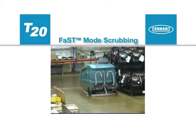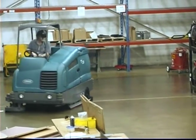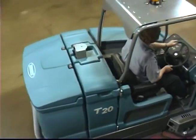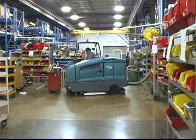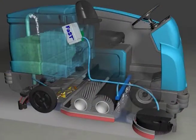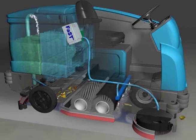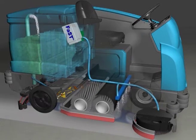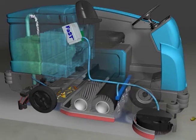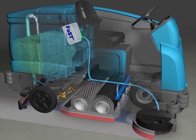Optional fast mode scrubbing controls and instrumentation. Fast scrubbing technology offers the advantages of using less water and detergent than conventional scrubbing. The operator will be able to scrub more area per tank of water using less detergent. This technology also provides the advantage of leaving a drier and safer floor surface. Unlike conventional scrubbing, the optional foam scrubbing technology, or fast mode, operates by injecting the fast pack detergent concentrate into the system with a small amount of water and air. There is no need to mix detergent with the water in the solution tank because the fast technology provides metered detergent and water delivery to the scrubbing systems.